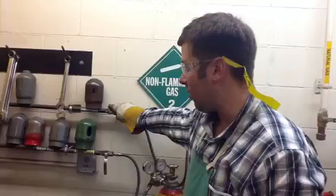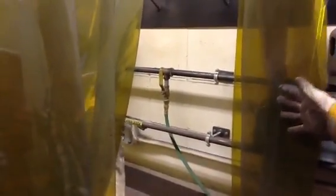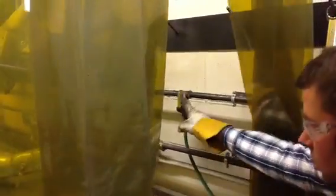Main line valve is turned on. Now the last thing I've got to do is give this thing gas as well. The top one — if you look at this — that's on right now and in line, so that means it is on. Somebody left it on. This would be off right now because it's opposite of the line. So I'm going to turn it in line. I've got gas blowing down here all the way to my TIG welder.